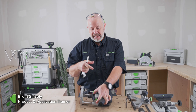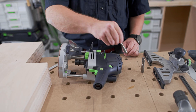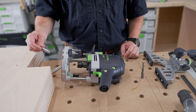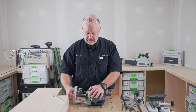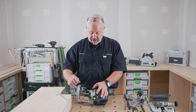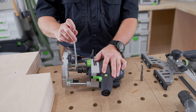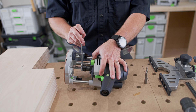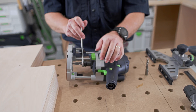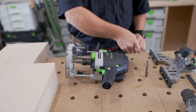There's a second stop in there — it's a safety stop. So once you break it loose that first time, you'll loosen that collet a couple turns and you'll feel it snug up again. That just keeps the collet from loosening up too much over time. Then I put the other bit in, get it finger snug, and then push the ratcheting collet with the up arrow. I like having it in this position so when I go to tighten it, I can use the leverage of the handle and just snug it up.